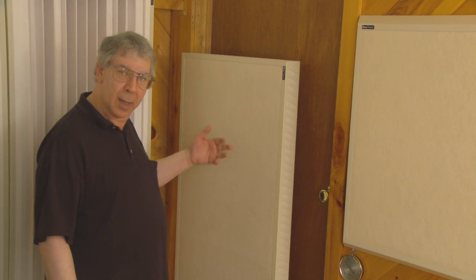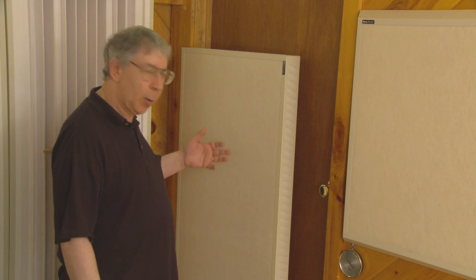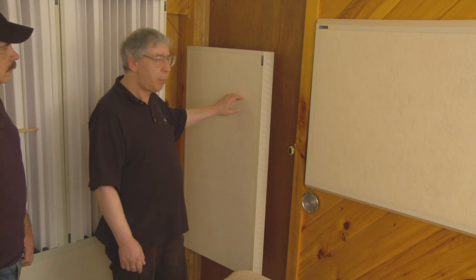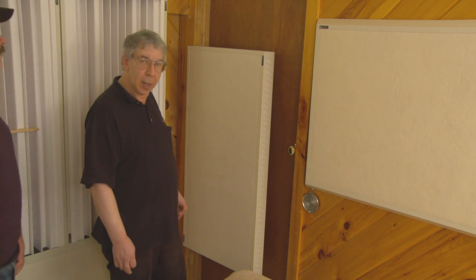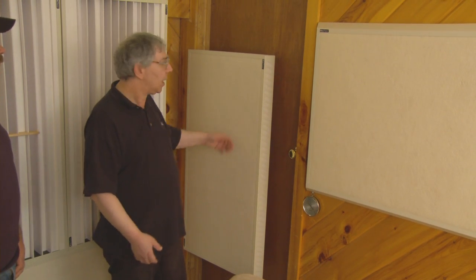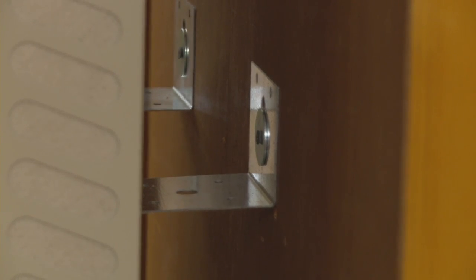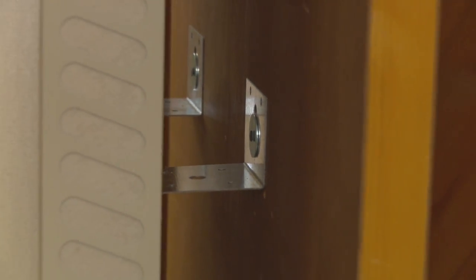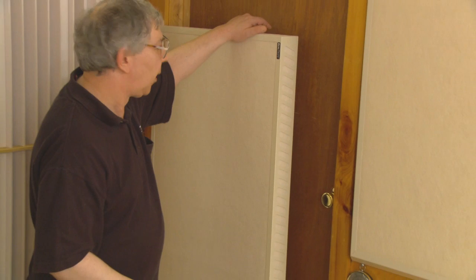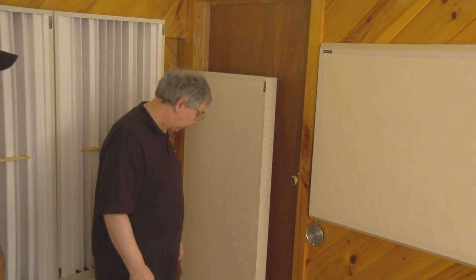A very common problem in home studios is there's a door in the corner — how can I put a trap straddling that corner? You can't, but you could put a trap on a stand. However, it gets really old if you have to pick up a bass trap and move it every time you want to go in and out of the door. So instead we recommend a MiniTrap mounted on the door. You could put a Mondo trap on the door, but a MiniTrap weighs 18 pounds and a Mondo trap weighs 28 pounds — so the MiniTrap is a very good bass trap, especially when mounted spaced off the wall with our post base kit at three inches, making it equivalent to a much thicker trap. It goes with the door, it's absolutely solid, opens and closes, doesn't shift around, and you can slide it to get it exactly in the right place.